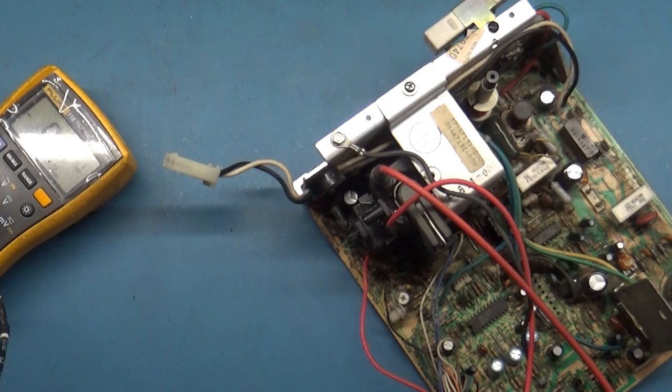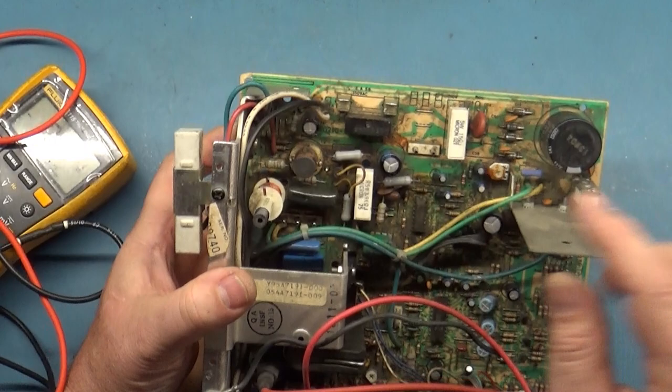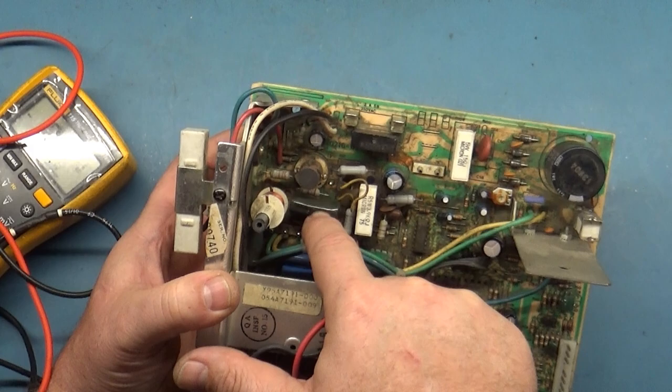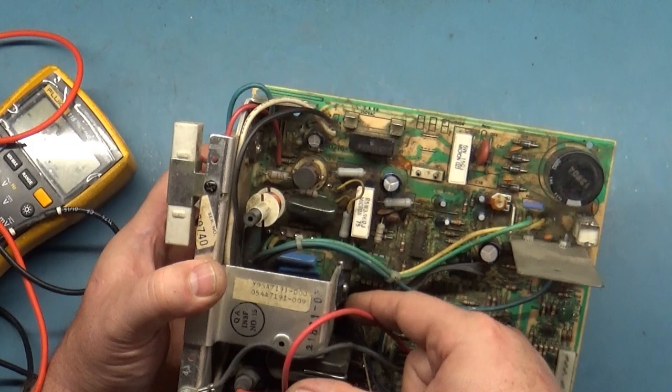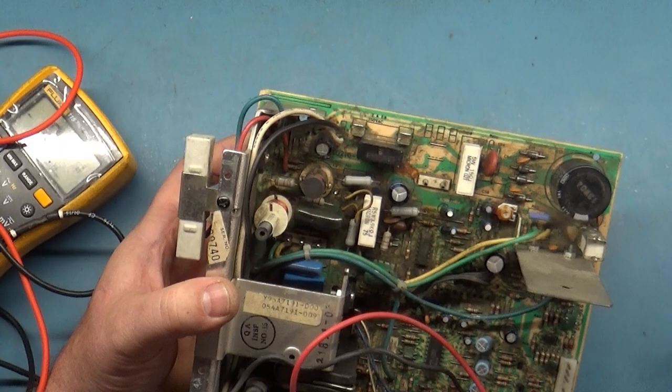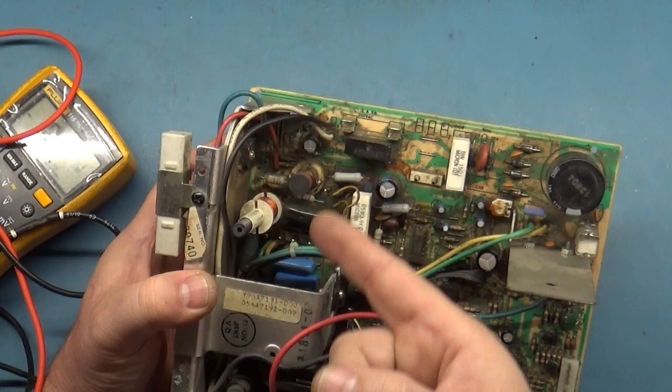So almost every time you get a blowing fuse chassis, it's usually HOT and voltage regulator, or one or the other. Now it could be a C38. I've seen C38 cause this to go, and these are actually okay. C36 can go out and cause these to be okay and take the fuse. So almost always it's usually HOT and/or the voltage regulator, but other times it can be C38 or C36 as well. So just keep that in mind. But I think the last three of these that I've done with the blowing fuses have been HOT and voltage regulator, and everything else was fine.